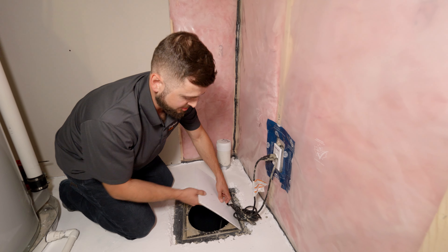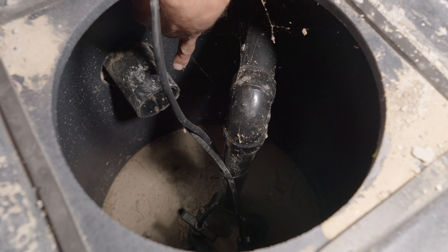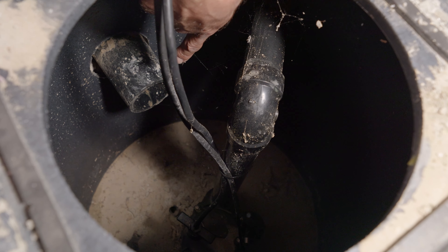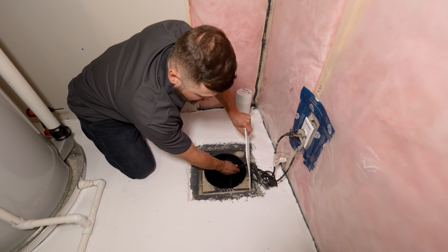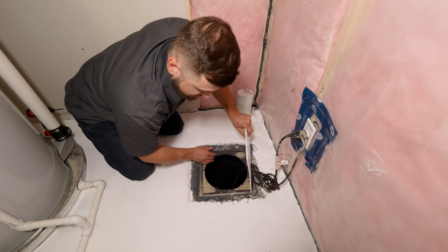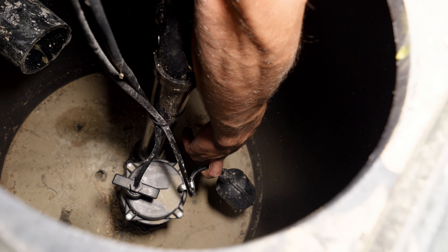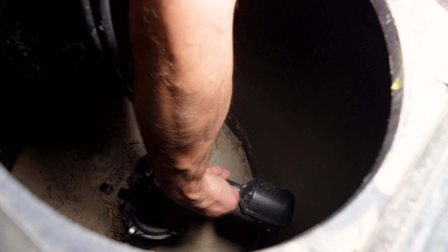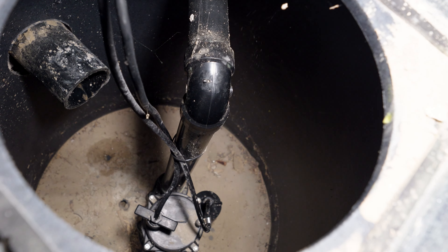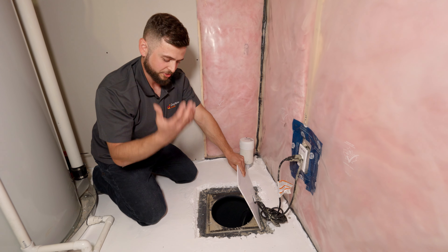When we go inside, there are a couple of things we're going to look for. We want to make sure that any debris that could have fallen in from the last year, or any sand or sediment, can be cleaned out at this point. We want to make sure those cables are free and clear of the sump, and we actually want to reach down, grab the sump, lift it up, and you should hear a humming sound. When you let go of that float it should stop. This is the natural operation of the sump as the water level rises and drops.